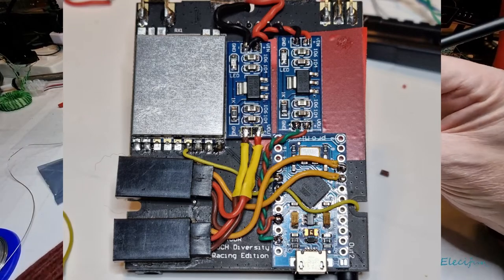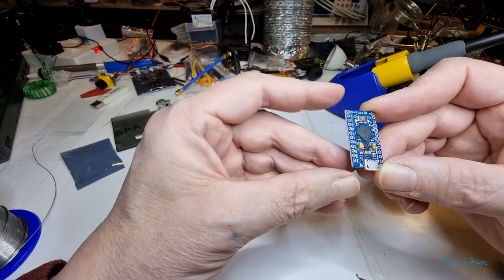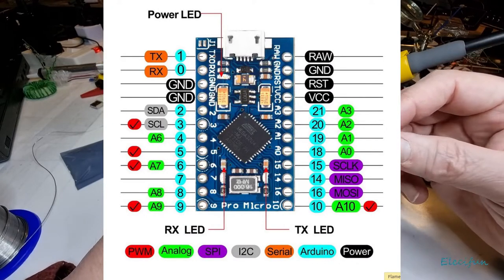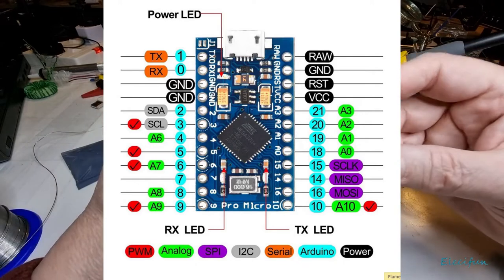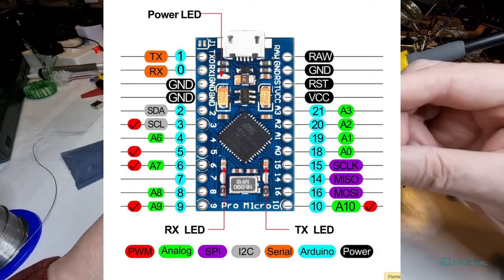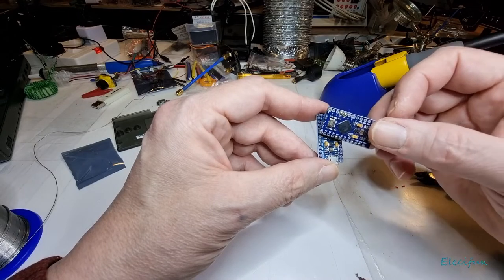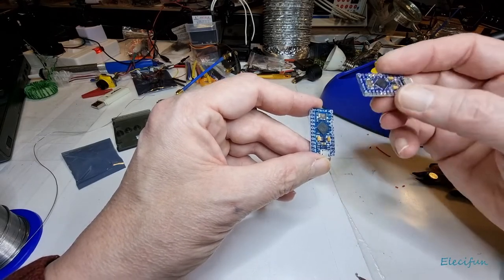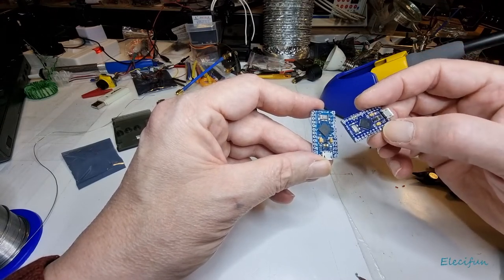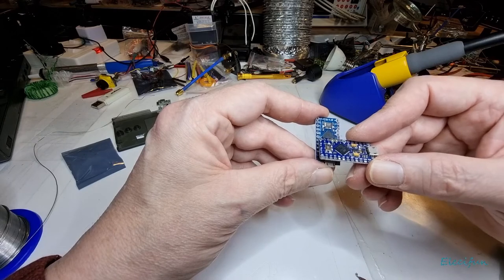Right, so let's take a look at one of these Arduinos. What we want is analog 0 and analog 1. We also want VCC, ground, and then we're going to need our outputs to control the servos. And we're going to be using servos 5 and 6. We don't have to adjust anything else here, the code's going to do that. The input's going to be A0 and A1 for the RSSI signals. Which way is it around? Well, we're going to do some experimenting just to make sure we do get those things the right way around. And we're going to say that antenna 1 is 0 and antenna 2 is 1. Yeah?